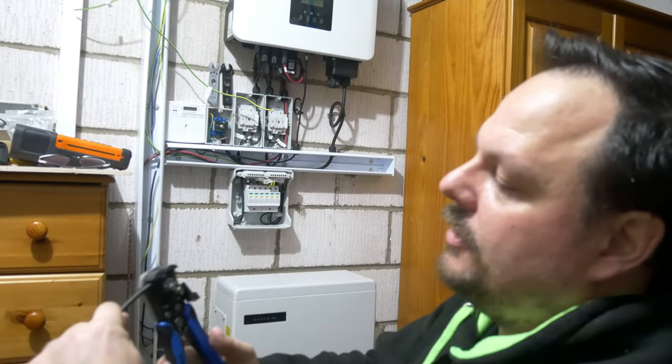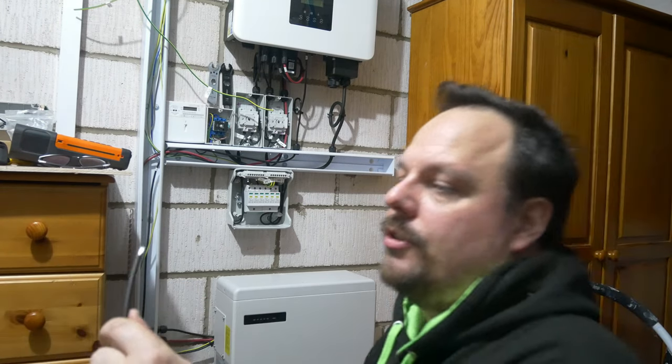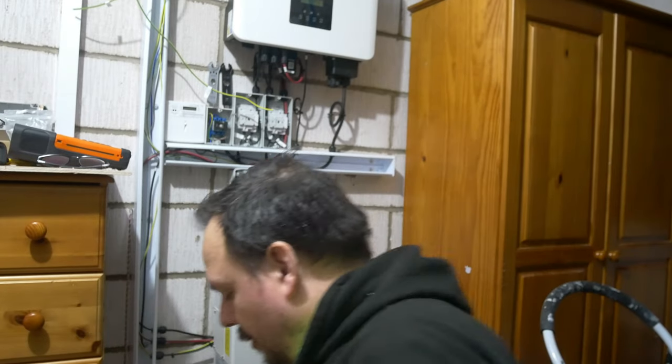Thinking about repetition when working inside a DC isolator — space is sometimes tight, it can be difficult to get your croppers in. That got me thinking about trying automatic wire strippers. I got these Klein ones — I use them on AC systems all the time, really good for downlights — but I wondered if they'd strip the double insulation properly. They do strip it reasonably nicely, though you've got the age-old problem of marks on the outer sheath of the cable.